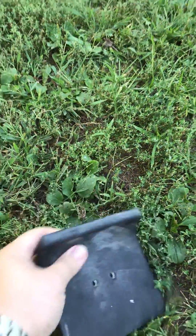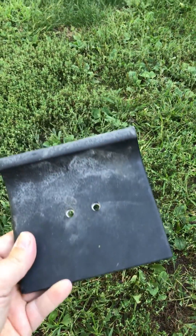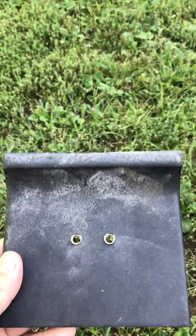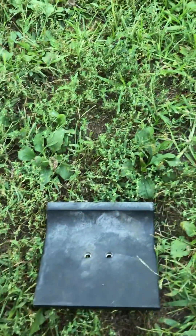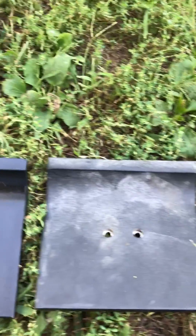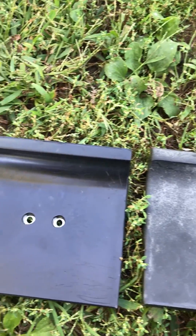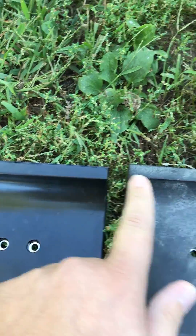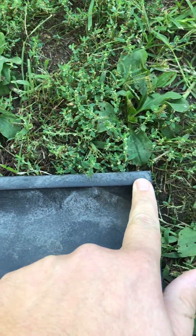First, here's the impact plate. This is off of a 9650 John Deere combine. You'll see it's got just a little bit of wear to it — not terrible. But when you set a new impact plate beside that, you can see the difference between them. Notice along this top edge: this new one has a nice sharp edge, while this one is actually starting to wear and has a little bit of roll to it.